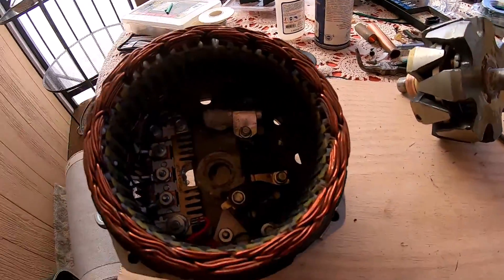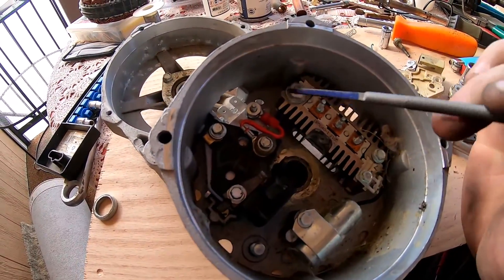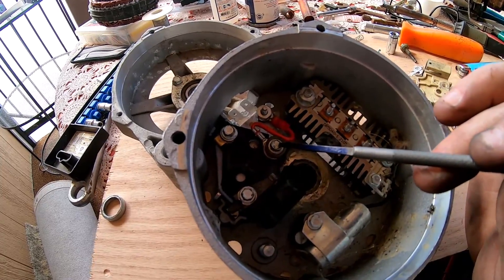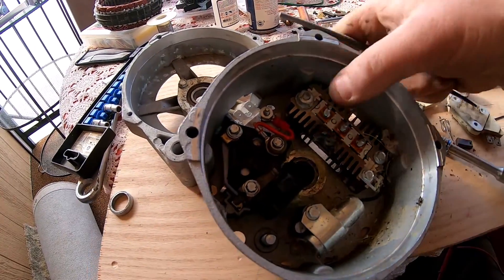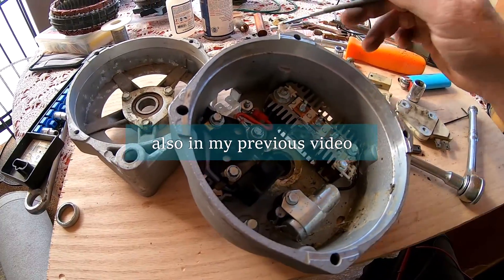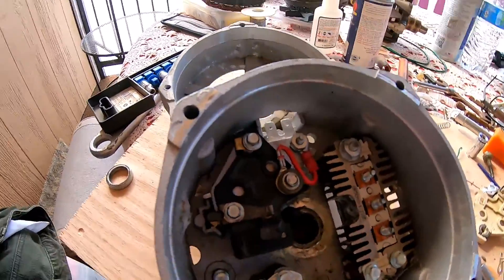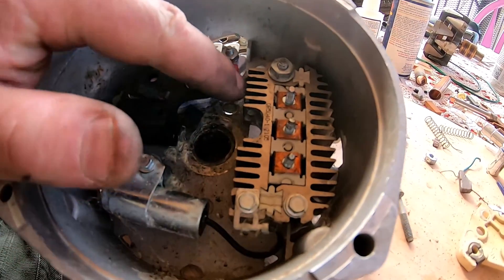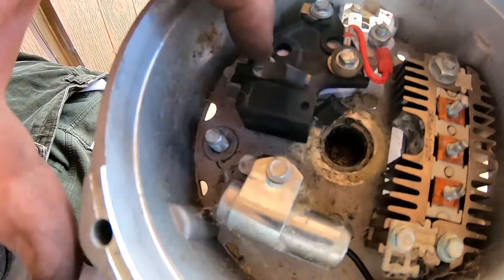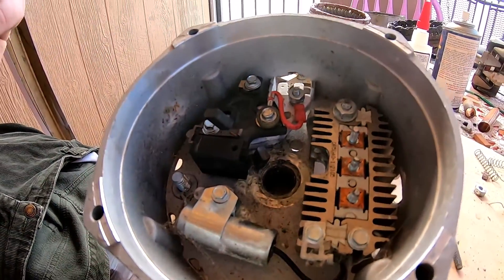I wanted to point out I made a really big mistake in my last video. This was the wire connected from here to there, and then I connected a wire from here to here — but all that did was tie in the bolt which goes back to the positive, so the alternator would have just been on all the time. That's not what we want — we want the ability to switch it on and off as the wind blows. So I disconnected that wire and hooked it from here to here. This remains the ground, and that's my positive.